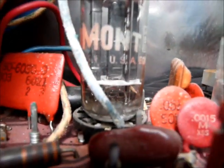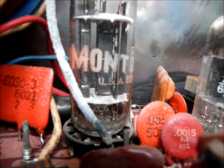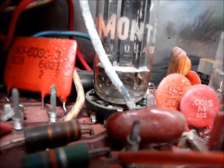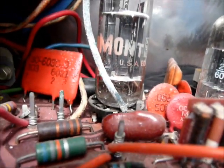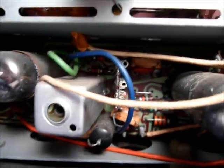You can see the blistering on this coupler and this gap in the vertical circuit. This is the vertical output tube here, and it seems like they're okay though. You can tell it got hot. I've seen these look kind of funky before.